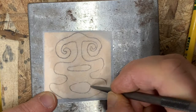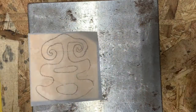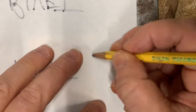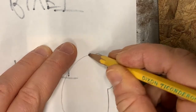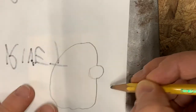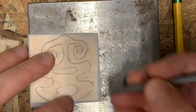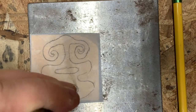I don't want to put the hole directly on the line either, because then when you're cutting, you'd end up cutting and you'd have half a circle cut out of your shape — if you drew and dented the hole on the line. So what you want to do is dent and drill the hole on the inside edge of the line.